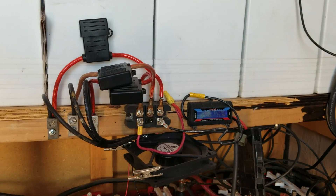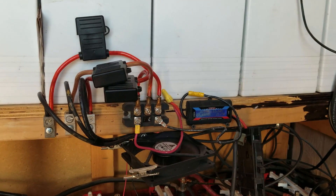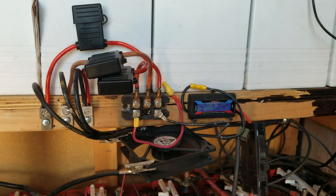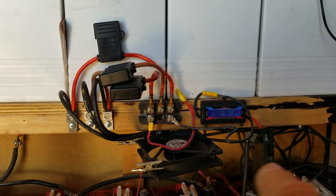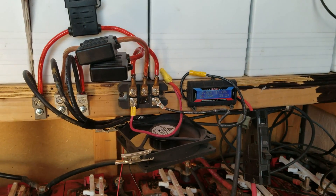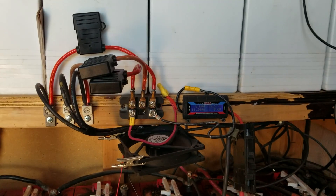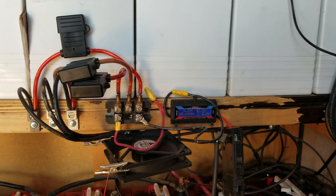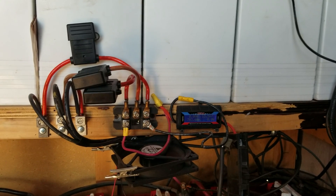Remember, there are two different types of turbines. You've got a PMA and then you've got a PMG — a permanent magnet generator. And then you have others that are junk that come from China. Like the last one I had — no matter what I did with it, no matter how I connected it, I still never saw even 200 watts out of a 400-watt PMA. So I stepped up and bought the KT5 12-volt, three-wire, three-phase PMA, and that has five blades on it.